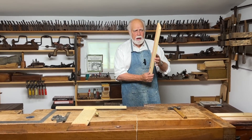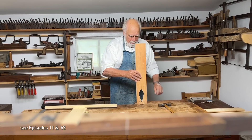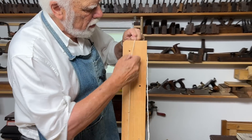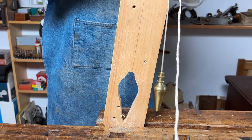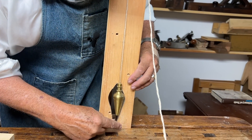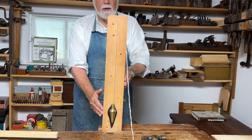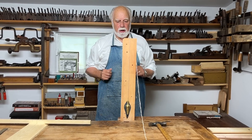You can take a piece of wood, and if you make sure that the sides are straight and put this in the vise like this, then if I hang my plumb bob — just put that in there — by moving this from side to side, you can see that when it hangs right in the middle with the point of it pointing at the mark down the bottom, I will know that this side is perfectly vertical. This is a really simple but effective device for making sure you're hanging something perfectly vertical.